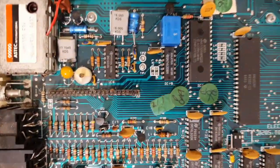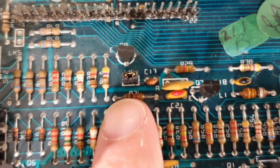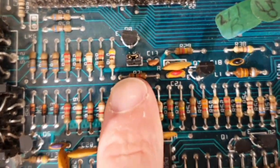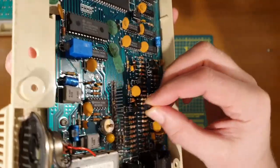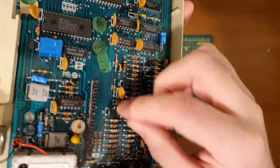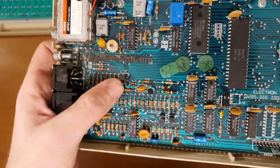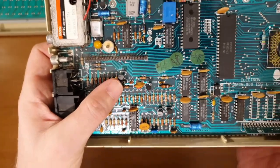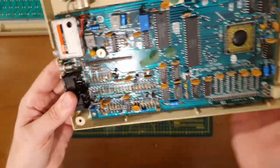I'll see if I can give you a nice close-up here. There's a solder jumper just here on the board and I've literally just put in two pins, and using a jumper just there, I can change the composite out from black and white to colour and back again at will. It just stays colour — it's just easier.